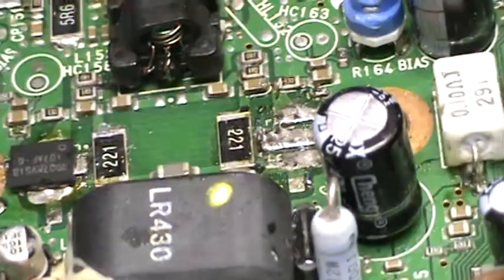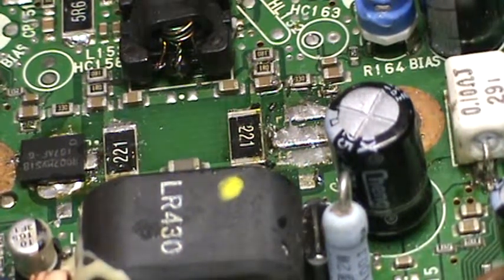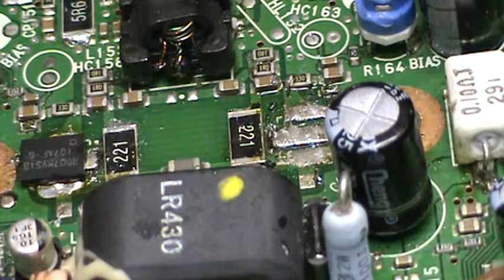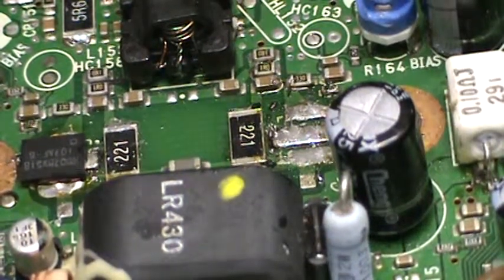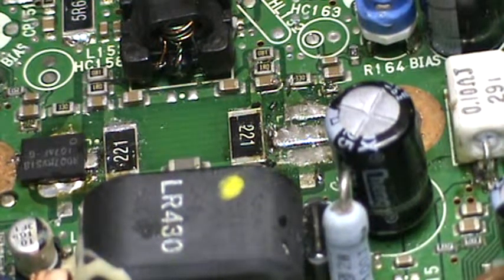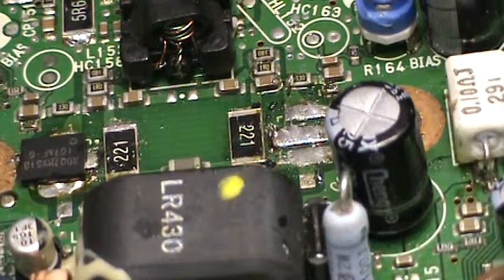Oh my. This is bridged. I bridged the MOSFET by tinning it. So to fix that. There. Okay, a quick swipe on the solder iron took care of that. Put it and take care of the chip flying across the room. Get it. It's down in my working drawer here. In the goo.